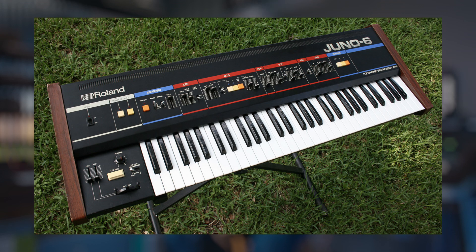So here's a panel board from a Juno 60, and let's pull a slide pot off of this board. To do that, you just grab it real hard and yank — just kidding. Nick desoldered this one before we went on, so it comes off easily. You've got to get on the back side and desolder it, and then you can pull it off. Here's the old slide pot and here's the new slide pot. There are very few differences. The main difference is that this pot has 40 years of use on it; this new pot is brand new, so it's going to work great — while the old pot could be sketchy, not feel very good, have some dead spots, whatever.